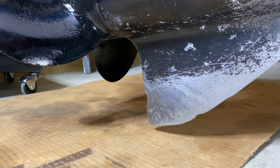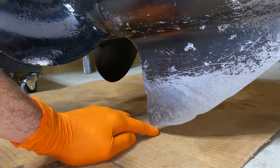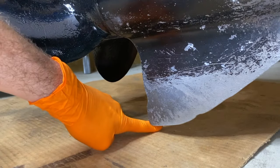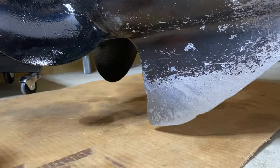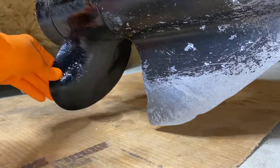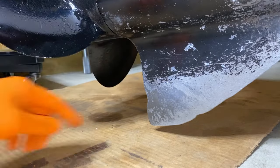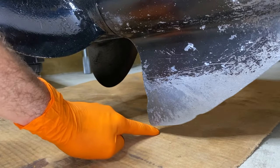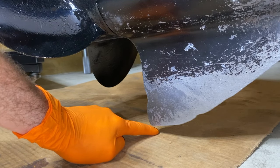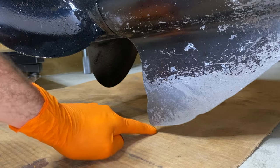We have the out drive in the full down position — about a half inch from the ground at the lower portion of the out drive skag. I can slide my finger underneath the skag and also move the cardboard. Try not to go any lower or higher than that prior to recalibrating and adjusting both the trim sender and trim limit switches.